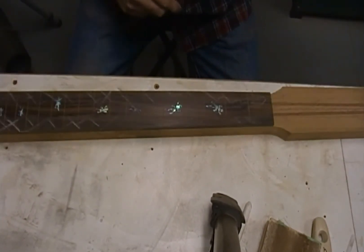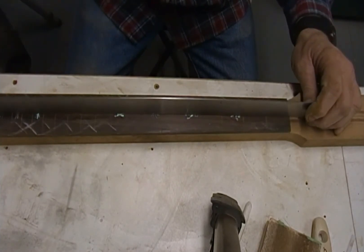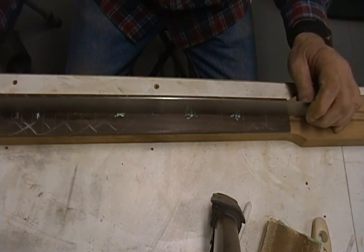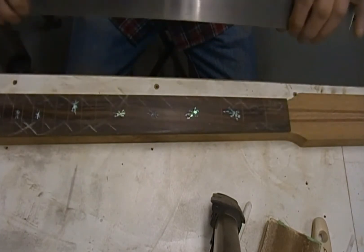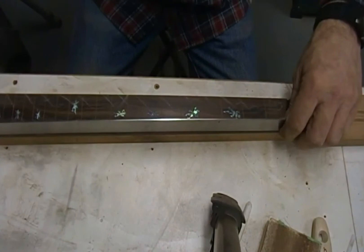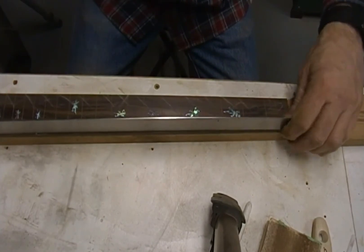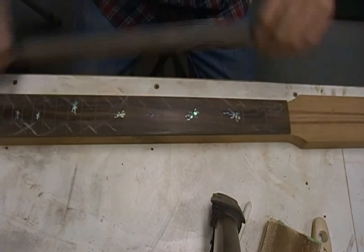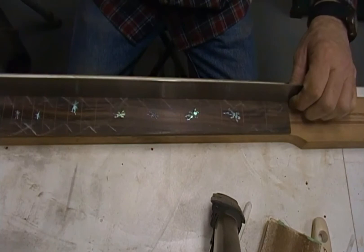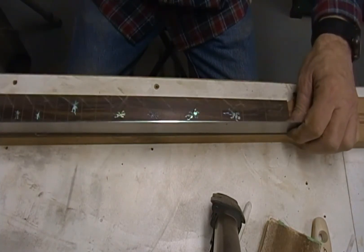Down the middle of the board with the straight edge, I'm pretty flat. I've got just the slightest little bit of fall-away up here on the neck end where it's going to join the body. Out here it's different than being on a cylinder - you test straight parallel to the edge of the neck. I've got a bit of a hump there, which is what I'd expect since I've got a 9.5 here and a 16 here and I have not tried to connect the dots yet. I've got a definite rock right in the middle, so that's what I'm going to work on now.